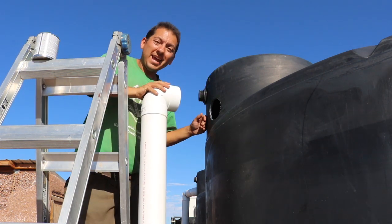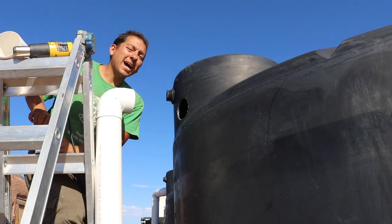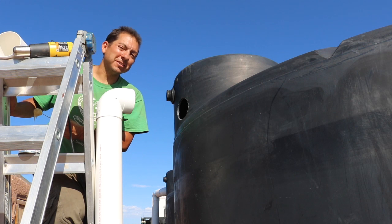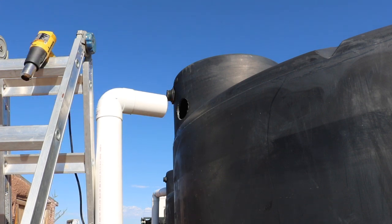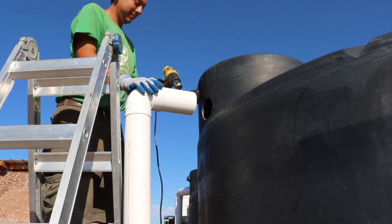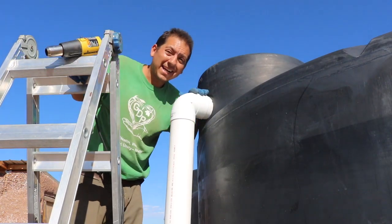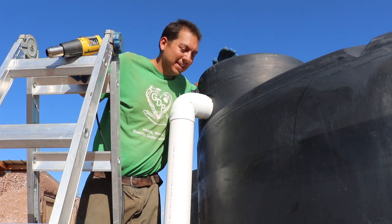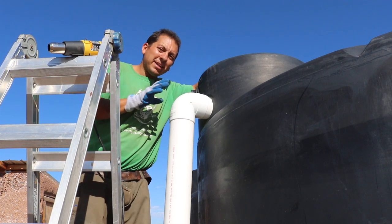I think it's looking pretty good. Now I just need to cut a length of PVC to get me from my 90 up into here. It's going to be a hot one today, getting up to 100 degrees. I definitely want to get this done ASAP, but still can't rush. Seems kind of crazy to be using a heat gun when it's about to be 100 degrees outside. Alright, I got it into where I want it to be. I'm pretty sure I've collapsed the pipe a little bit on the inside, so I'm going to heat it on the inside and flare it out — that way it'll lock it into place.